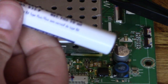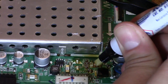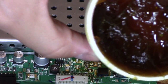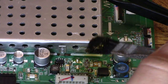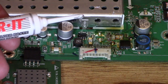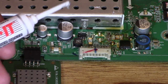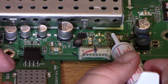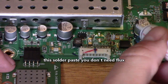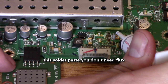You can use your flux pen and that's going to help bond the solder on the solder pad. Or you can use flux in a jar — it doesn't really matter. This is a little bit sloppier though. I'm going to use just a little bit of solder paste — this is the lead free one — and just a little bit right there. And then we're just going to wipe it across the solder pads — a little goes a long way. And then just a dab in the center.